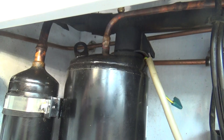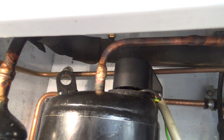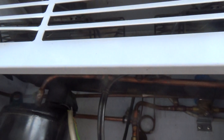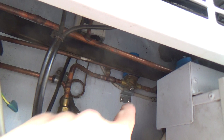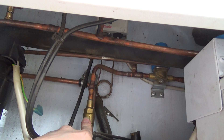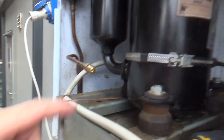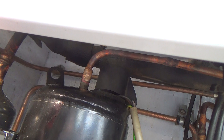It's not pretty, but I think we've got it. It looks better around the back where that little suspect pinhole was. We got all the gas out of it, and the trouble we were having was that the discharge pipe was shut off by two solenoids, so we still had a tiny bit of pressure in there. Even with the magnet on that valve, there's a check valve there — I didn't realise — so it couldn't get rid of the one or two PSI through that check valve. We had to swap to the further side, which is open to the condenser. We got it warm and then it just blew a hole in it. Hopefully that's got it.